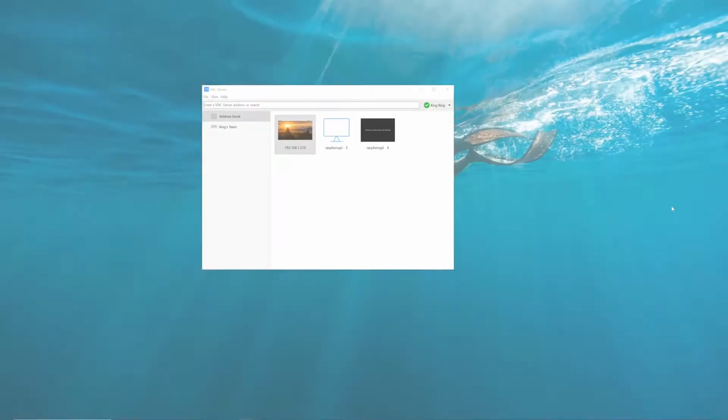Okay, so we are a step closer to actually writing our script. I have done the setup. I've completed setting up the operating system on the Raspberry Pi. I have also installed a VNC server on it so I could remotely access it. So what we're going to do now is connect to it remotely. We will install Python libraries, we will install the IDLE, and then we will also install some GPIO libraries as well. Then we could get to writing the script.